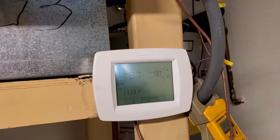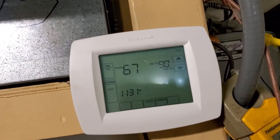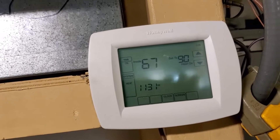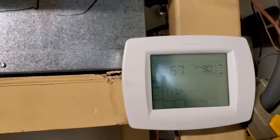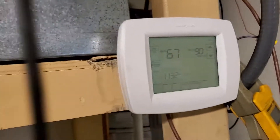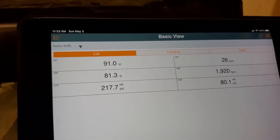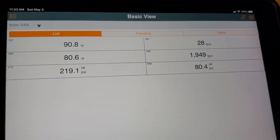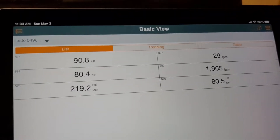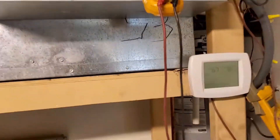This thermostat isn't going to work the best but it's probably going to get the job done for a few days. I've had this two-stage Honeywell touchscreen sitting in a box for years, and when I pulled it out the batteries were leaking. The paper tab was still in there for the built-in battery — that battery is probably bad, but who knows — it's a little 2032 watch battery or whatever is in there. That thing's reading slow — it gives a temperature with a little thermistor in there, it's just not fast; it's made for airspeed.